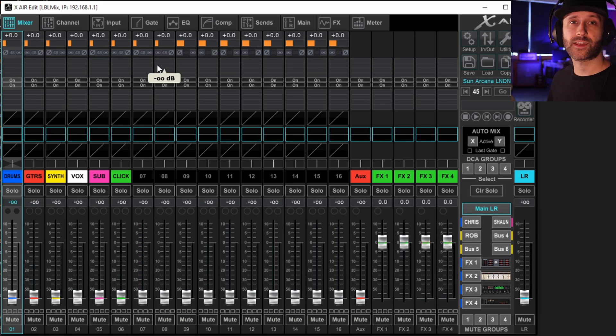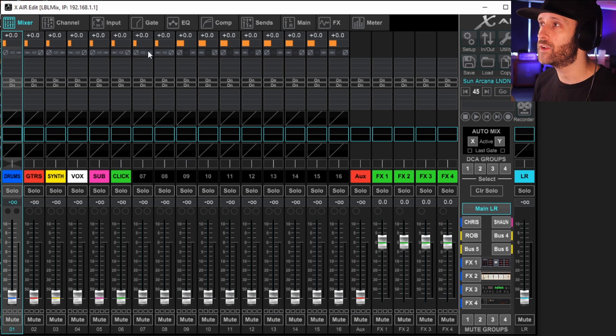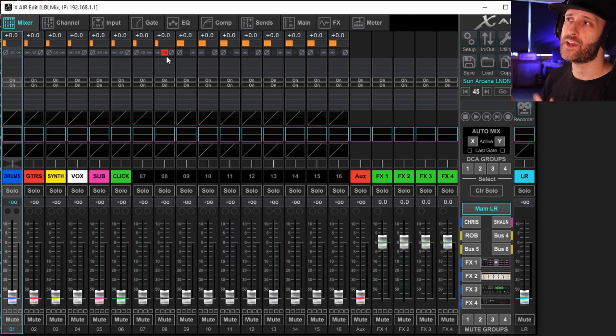If you've connected your in-ears mixer through the link outs to provide phantom power so you can rehearse with your rig, you need to turn on phantom power for each channel. It's up here where it says 48 — for 48 volts. Just right-click to enable it. Phantom power can only be provided through the combi ports on the X-Air — there are eight of them. When working out your patching, make sure any mics that need phantom power are in those first eight channels, otherwise you won't be able to give them phantom power through the jack ports.